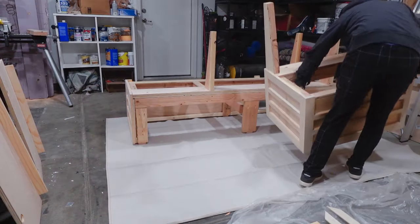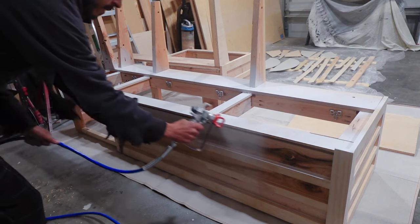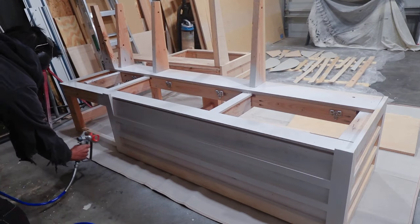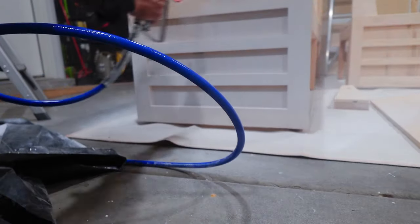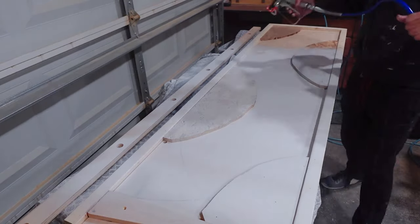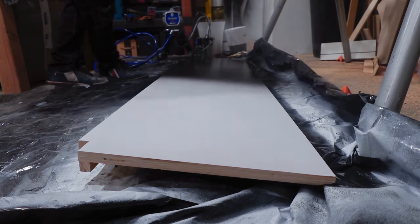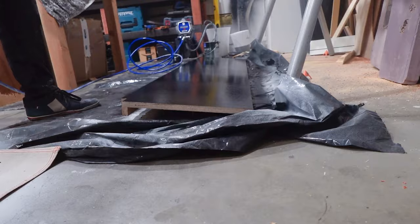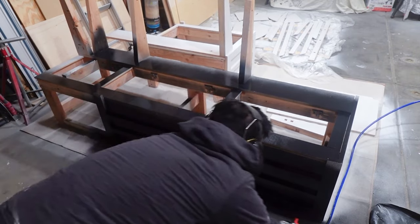I got the room ready and dust-free, used some air to clear off remaining dust, then applied a base layer of primer — keeping an even distance between the bench and the sprayer to avoid pooling. I made sure to spray all sides and spray the different backrest pieces as well. For the top coat I went with Sherwin Williams black enamel paint, semi-gloss, doing two coats and sanding between the primer and top coats, and between the two top coats, with 300-grit.